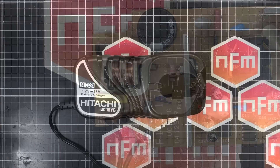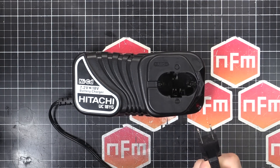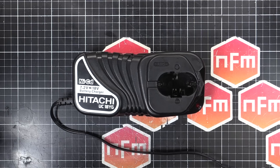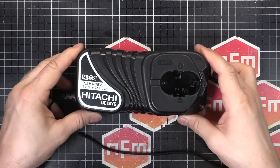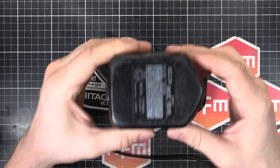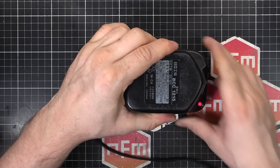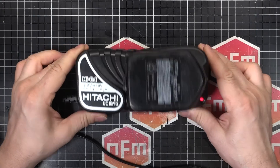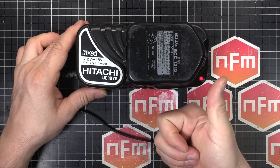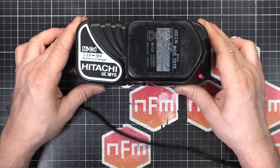Time to put the case on and see if it works. We're all back together — moment of truth. I'll keep my hands away just in case there's a pop. And absolutely nothing — perfect. That's exactly what I wanted. No sparks, no smoke, no funny noises. I've got the empty battery — the one we tried to charge when it was plugged into 200 volts — and the LED comes on. It is charging! It's working. Fantastic. We fixed the charger. That can be ready for Monday's work, keeping the Japanese internet running nice and smooth.